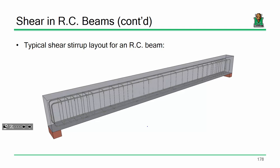This is sort of what I was saying earlier with the compression steel. From a design standpoint, at the very least for a beam like this, you would need tensile steel to resist the moment, and you would need these stirrups to resist the shear. And a lot of times, just to make the darn thing easy to tie together and lower into the forms, we throw a couple bars up top just to tie everything together. It's not even really for strength purposes, just to make it a little easier to handle. So that's sort of what I was saying earlier, that we don't necessarily need to design for compression steel. We could account for it because it's there. You see what I mean? Does that make sense to everybody else?